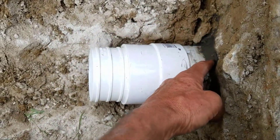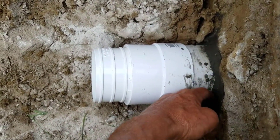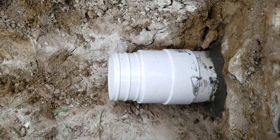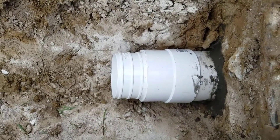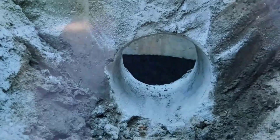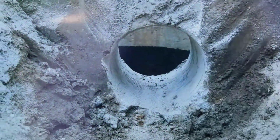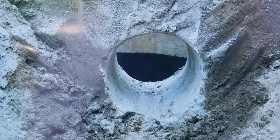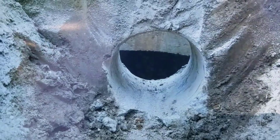As you can see, we use hydraulic cement around the schedule 40 sleeve. That's how the DPW wants it — that's how you connect your French drain system to a tap on a storm drain. When you run a French drain system to a storm drain catch basin, not all catch basins are sleeved; you have to core drill the majority of them.